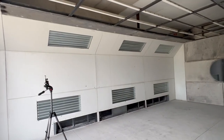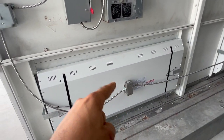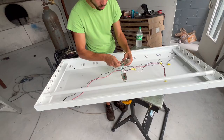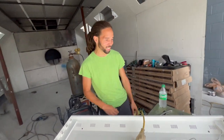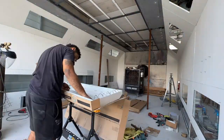Yeah, it looks like we have lights, but we have a little issue. I figured out what it is — our ballast doesn't match our bulbs. These are single-end ballasts and the bulbs we have inside are double-end. So we're going to do this 11 more times. Alright guys, first time testing out our lights.